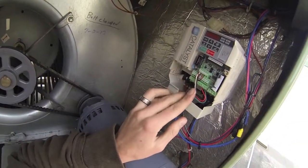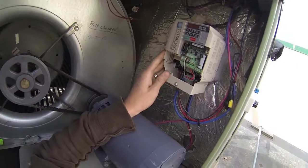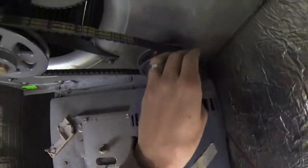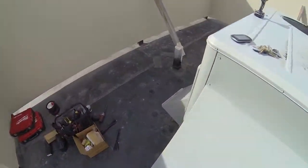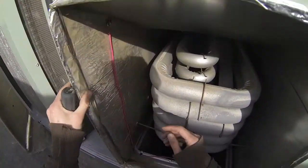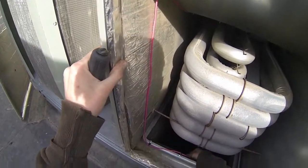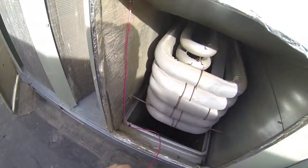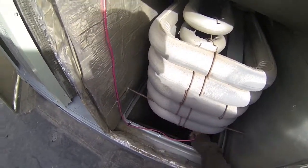The drive has the purple four-conductor landed onto it with the power and motor side on the right and line side on the left. We have our pink two-conductor which goes into the supply, feeding down into the supply compartment. It's secured high above the heat exchanger to avoid melting, hanging about two feet into the supply so we're in the air stream rather than picking up heat from the heat exchanger.